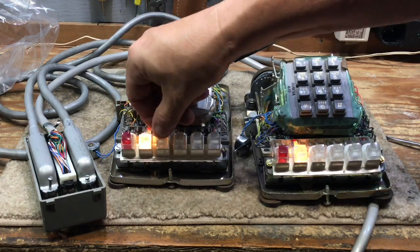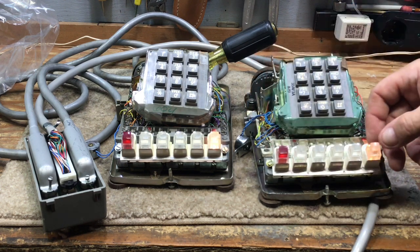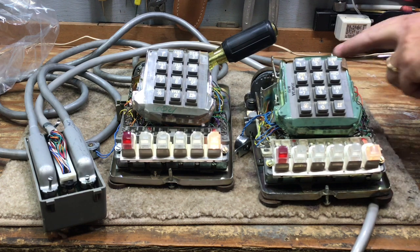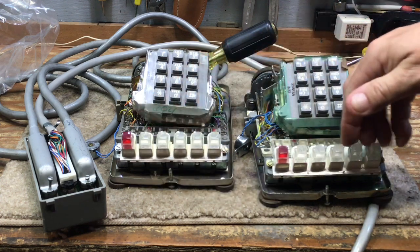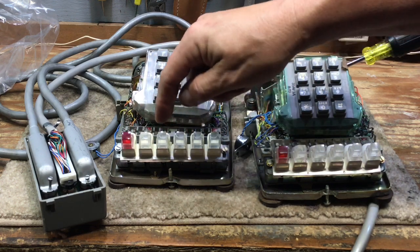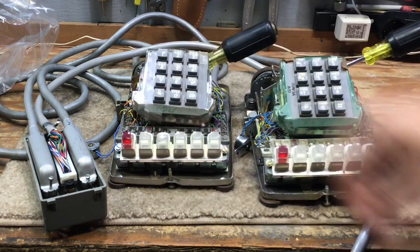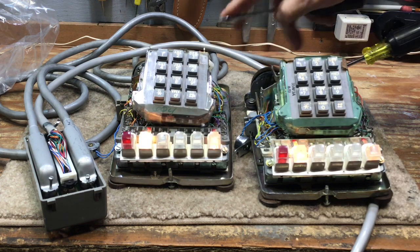I can place it on hold, I can release it — works perfectly. As long as all of the line keys in both telephones are released, you have no problems. But if you have two of these phones on the same cable and you press any line key on one phone and any line key on the other phone, unless you press the same line key on both phones, you've just made a conference circuit through the bridging adapter. This is a moving target if you try to find this on a working system, because someone will make a phone call on line five and then later hang up the handset, somebody will go to this phone and pick it up — and they have two lines on that phone, two dial tones.